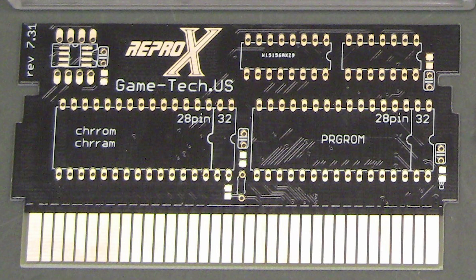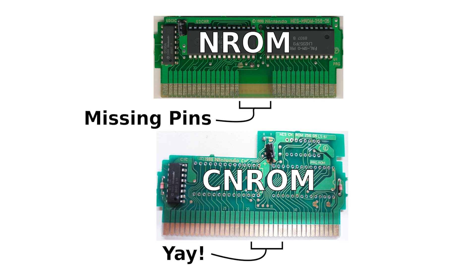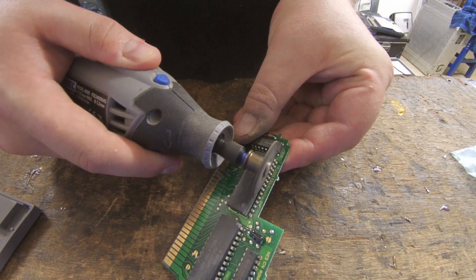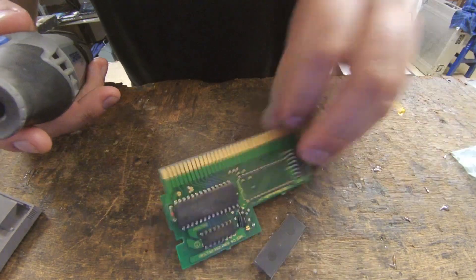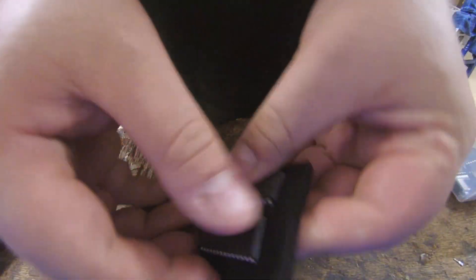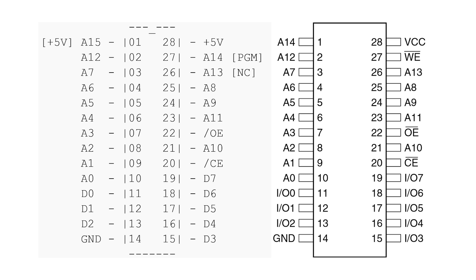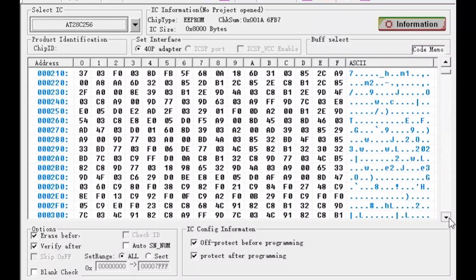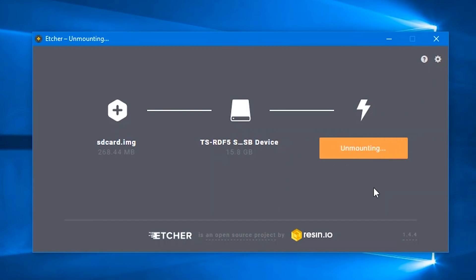If you live somewhere where you can get reproduction PCBs and cartridge enclosures fairly cheaply, I'd recommend doing that instead. It would be cool to design something that combined the FX2LP chip and the cartridge connector on a single PCB, but I can't really be bothered. This particular game is a CNROM cartridge, one of the simplest available, and unlike many others it has all the cartridge pins — important because we need the right strobe signal to transfer controller input. We start by using a 3.8mm Gamebit screwdriver to open the NES cart. Remove all the ICs except the CIC lockout chip; since the board is double-sided these can be a pain, so I just dremeled all the pins off the ICs and desoldered them individually, then braided the solder out of the holes. The 28C256 EEPROMs have almost exactly the same pinout as the Nintendo mask ROMs, so minimal hacking is required. You'll also need a TL866 programmer, available for next to nothing and works really well. While on the computer, write the Raspberry Pi Doom image to an SD card and program the USB controller's firmware too.